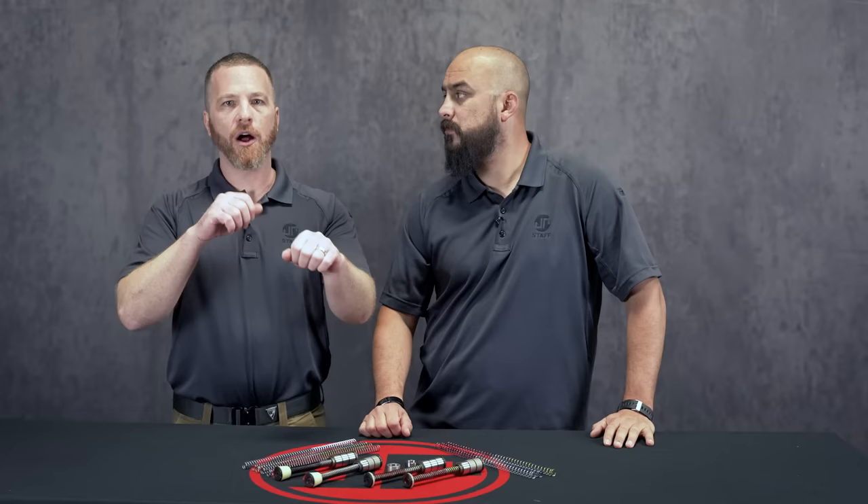You can look at your rifle and use brass ejection charts showing where brass ejects: toward one o'clock means too high a bolt carrier velocity, around four o'clock is about correct, and further back means low bolt carrier velocity — possibly indicating worn gas rings. Also, when you first put a suppressor on a rifle that hasn't been additionally tuned, the ejected brass is going to be covered in carbon fouling — completely black. That tells you the bolt is unlocking prematurely from the chamber.